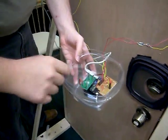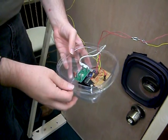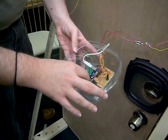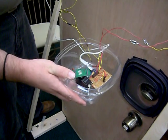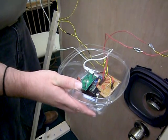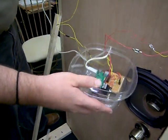The way the circuit works, or the way the development housing is made, we used cheap clear Tupperware to mount the servo in, and this is just some printed circuit board to give ourselves a stiff structure. That is the servo in action — as someone authenticates to it, or if there's a manual override, the servo will actuate and turn the bolt to the correct position.